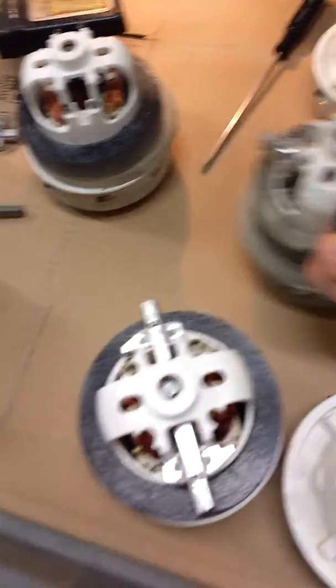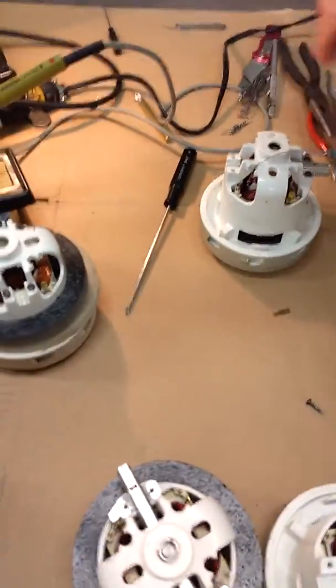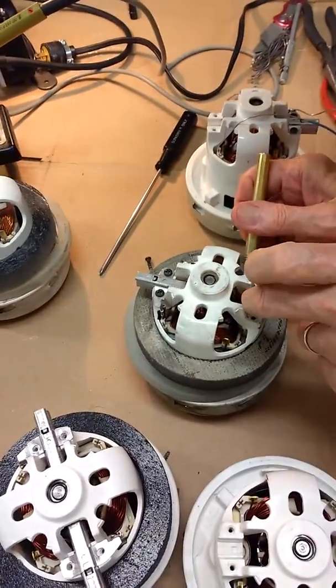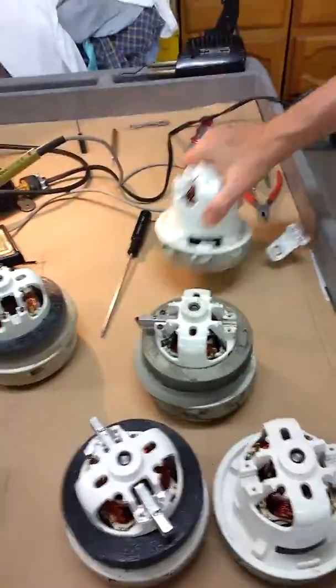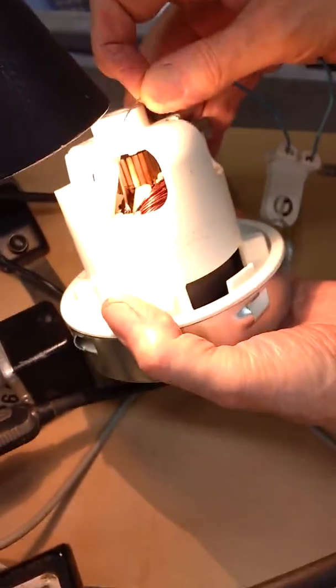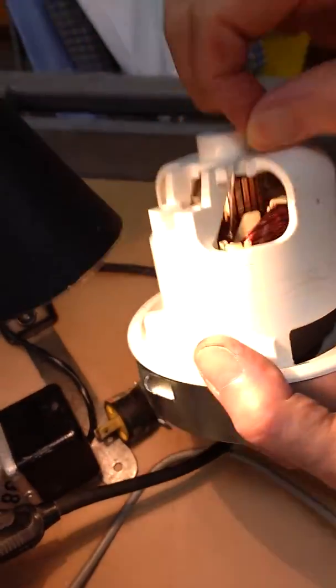Here's the wire. So you strip it — use something like this to get the insulation off one side, then use an exacto knife to get the other side. You scrape it all off — it's not easy, but you scrape all the insulation off. Then you make a hook on it, like this. Make a hook and then you hook in another piece of wire, so you've got a connection there so you can link it. The best thing to do is to do that with a new one.